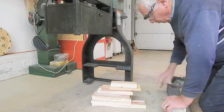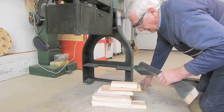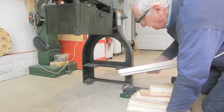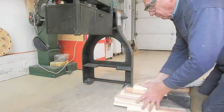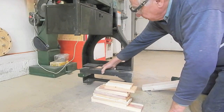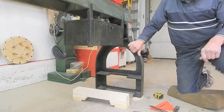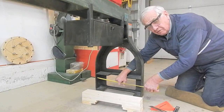Let's start by building what I'll call pivot blocks or jacking blocks. This is a glued-up assembly that lifts the lathe by the webs built into the legs at each end of the lathe. I need to build a block for each end. I've got a 1x4 and a 2x4 and a bunch of scrap 1x4 pieces — actually 3½ inches — that I'm going to glue together so I can saw out this pivot block, one for each end. I've glued and clamped the pieces together for two jacking blocks. To fit the jacking block into the lathe legs, we need to cut it to a length of 19 inches.